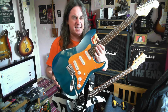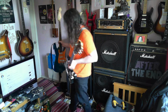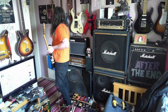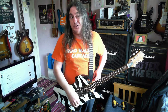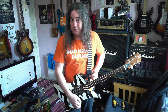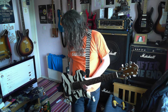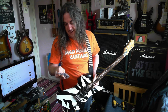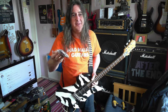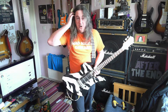The one thing that's let me down on that is the 3-way switch needs to be an on-on-on switch, not an on-off-on switch. I had a couple of them in this guitar before I took them out, because you needed that to do the series parallel coil tap switches, and they weren't that expensive. I can't find them now. Normally I can buy a bag of switches from China for under £1 each, like 15 quid for 20, and that's for 2-ways and on-off-on switches. I've been trying to find the on-on-ons and I just can't find them anywhere.